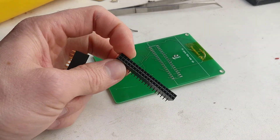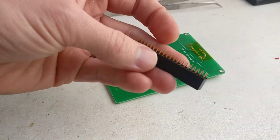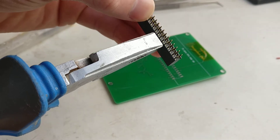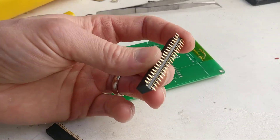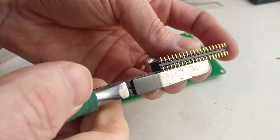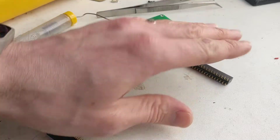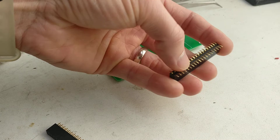These are 20 by 2 female headers. They start out life like this, and then what you do is take a pair of pliers, take them by the tip, and then you just pull the ends down, putting them over 90 degrees. Then get a pair of longer nose pliers and flatten them out, just to get them kind of all straight. Maybe put it down on a bit of concrete and then just give it a little tap with a hammer, just to get the nice 90 degree angle there at the back.